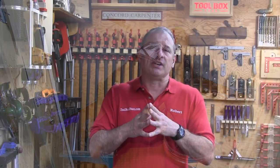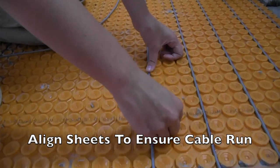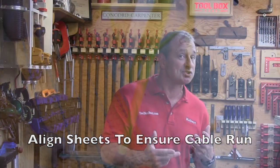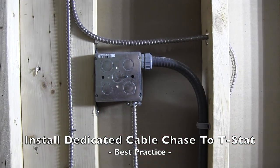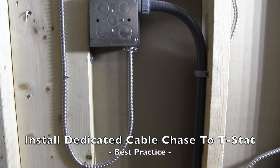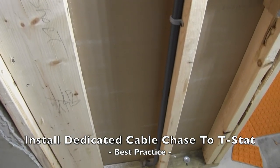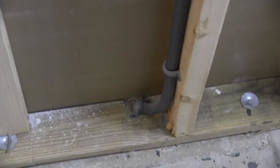When aligning your sheets, make sure you align those studs so they line up straight so the cable runs well. Cables cannot cross, overlap, or touch one another, so you have to lay your system out carefully. When running your cable from the thermostat down to the floor, use a dedicated cable run installed by your electrician. This type of dedicated wire chase is also good for cold lead sensor wires.